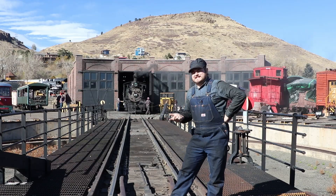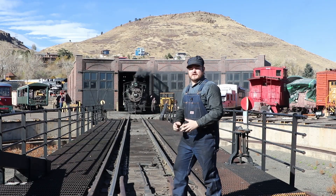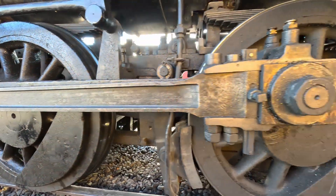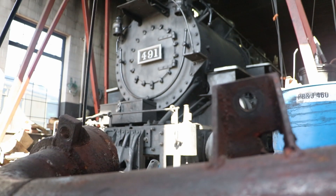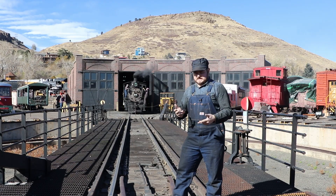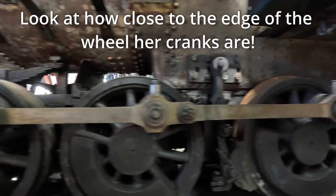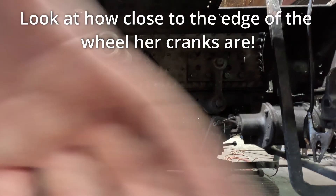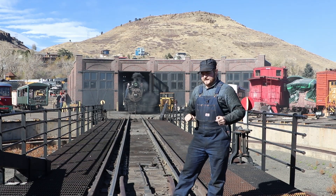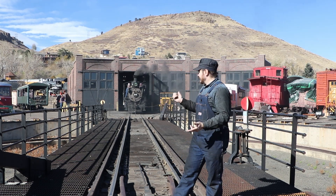That's a big reason why steam locomotives have very different driver sizes — you needed that right balance of speed and power. And that specific nature of driver size and tractive effort is actually where the roundhouse became a thing and why it stayed a thing for so long, and also why we don't really see roundhouses anymore. The roundhouse was very specific: you had a turntable where you could pick one locomotive — I need that one locomotive. RGS 20 steaming up just across from me, or in the stall to the left 491, a big brute locomotive that could haul a ton of cars but not necessarily as fast as 20 could go, or the 346 to the right, a little 2-8-0 with the same amount of power as the 20 but less speed because it's got much smaller drivers. You needed the right engine for the right job, so you had to be able to pick that individual locomotive, pull it out, and assign it to the train it needed to go on. When the diesel locomotive came around, that changed everything, and that's why roundhouses tended to go away.